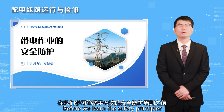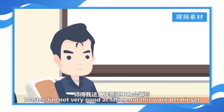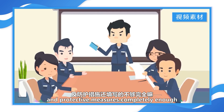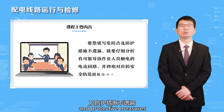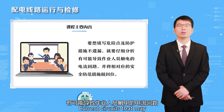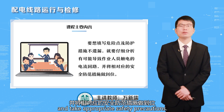Hello students. Before we learn the safety principles of the insulated glove method, let's watch a little animation. A student says they are not very good at filling out the work permit. The master asks whether the danger points and protective measures were filled in completely enough, and how to analyze the dangerous points without missing anything. To fill in the danger points and protective measures, we must carefully analyze circuits that may lead to electrocution of workers and take appropriate safety precautions.